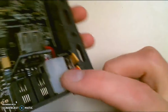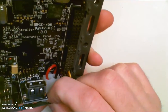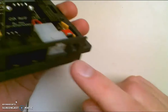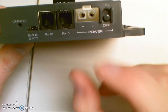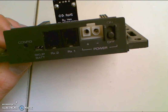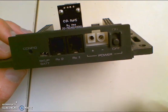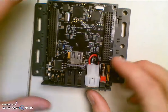You can re-solder a new female housing onto there. Also, these Tamiya connectors are not the greatest things either, so this allows you to pop one of those off — you could desolder and re-solder one of those if they wear out. I would encourage you to buy the one-foot cable extensions so you can plug those in and leave them in the Cortex, and then disconnect and connect your batteries with that. That will save this port on your Cortex, and if you damage the extension, it's a $3 or $4 cable versus having to fix your Cortex.